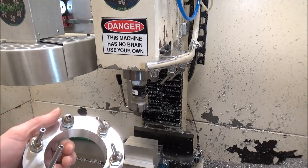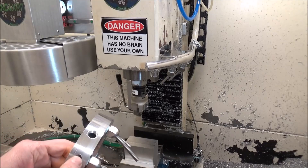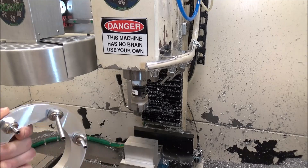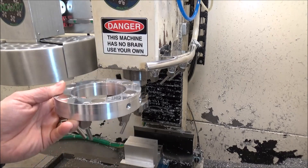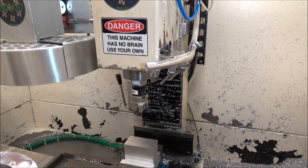The coolant ring has six nozzles — one is for an air blast to kind of clear the chips and the other five are for flood coolant. Of course it's magnetic so it just magnetically rests up on your machine and it's easy to take off and mount if you need to remove it for any reason.